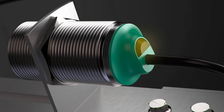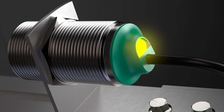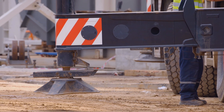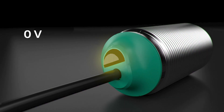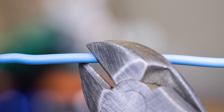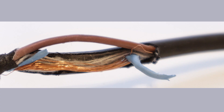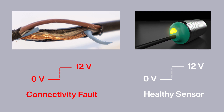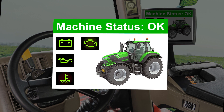So let's dig a little deeper into sensors. Traditional proximity switches provide an on-off signal to a machine's controller verifying the presence or absence of a metal target. Their task could be anything from monitoring a wheel or shaft's rotation to confirming that an outrigger is fully extended. A standard proximity sensor signals zero volts when a target's absent, and the supply voltage around 12 volts when one's present. But those faults — a cut wire, a broken connector assembly, or worn jacket insulation causing a short — can generate the same zero or 12 volt levels that a fully functional sensor provides. So a controller has no way of telling the difference between a fault and a healthy sensor, and the cab's HMI will tell an operator everything's normal when it's really not.